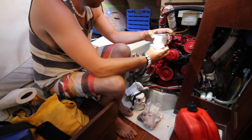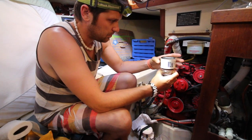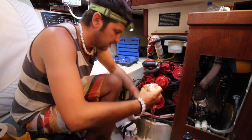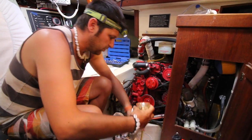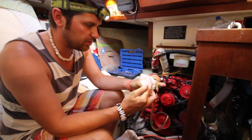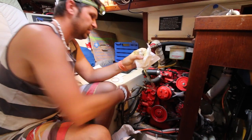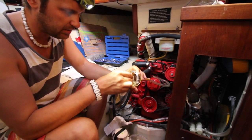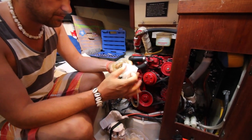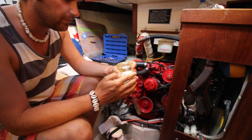We separate the fuel filter element here. I don't run these anywhere near long enough for them to clog. With our fuel as clean as it is I could probably run one of those elements for a couple of years, but I like to change them out at least bare minimum once a season — sometimes more if I'm motoring long distances like we are here. It's just not worth getting stuck somewhere for a clogged fuel filter for 20 bucks.